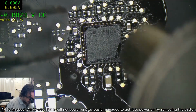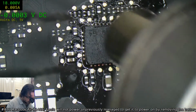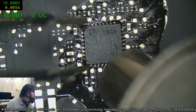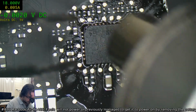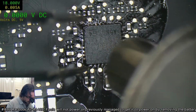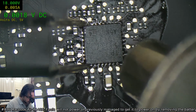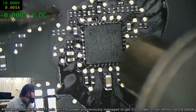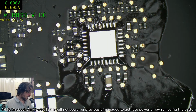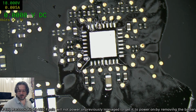With all electronics, there's always going to be one. Well, there's going to be several. There's going to be points on a circuit board that are critically sensitive to such things as little spots of corrosion. It's just a luck of the draw whether your corrosion's going to land on there or whether it's just going to land harmlessly on the board. Or maybe on some capacitor that really doesn't have a critical function other than just sitting around being a Me Too capacitor.